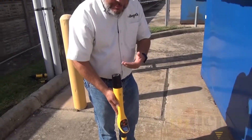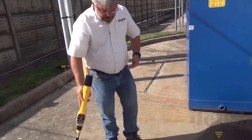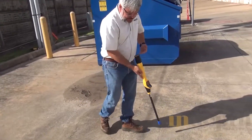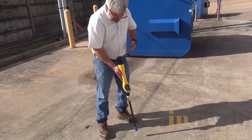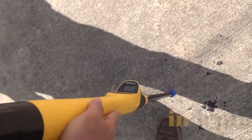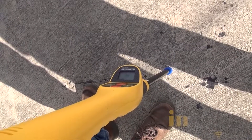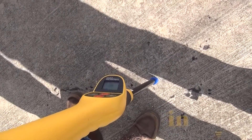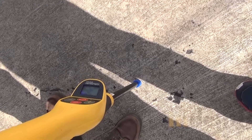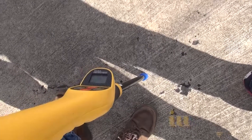Notice how the sound is getting a little quieter because I'm further away from the target line. Now we're locating that line out — notice how I'm cutting the cable in half. Once I get it so far, I want to check the depth, so I'll get a location first. The number is not as high as it was before — it was around 50. There are two reasons for this: we've gotten further from the transmitter and lost some signal, but also the cable may have gotten deeper into the ground, so the signal has a greater distance to travel to the antennas.